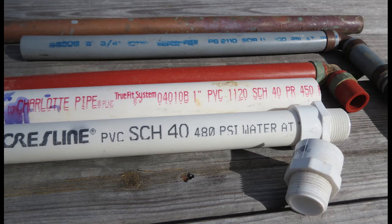It's possible you could have one of these two pipe types in the middle of the photo. The gray one — hopefully you don't have that — that's polybutylene. I actually installed a lot of that stuff back in the 80s and some 90s, and I never had any callbacks on what I installed. The red one at the bottom is PEX. There have been some brands of PEX that have been recalled and deemed defective, and the same goes for polybutylene. Usually when I did a home inspection, if I didn't see a lot of repairs, I assumed that particular batch didn't have problems. The fittings were also an issue for both PEX and polybutylene — a lot of this comes down to how well the material was installed.